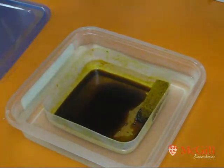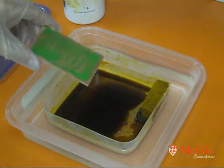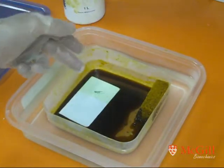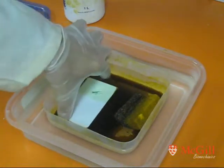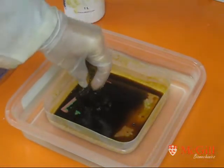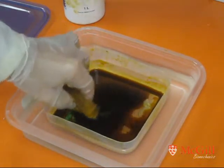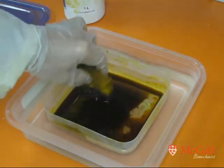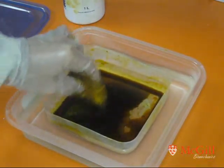The first pool has the ferric chloride in it. The second is just a little warm water bath surrounding it to keep it warm, and it just speeds the process up a little. I'll dip my board in — you have very little in here, only enough just to fill the bottom, because it's the sponge that's holding most of it. Usually I flip it upside down at that point — most of the chloride's in the sponge. I'll squeeze it out and then just begin the rubbing process. With the warm water it really only takes less than two minutes — about 45 seconds to two minutes depending on how potent your batch is.